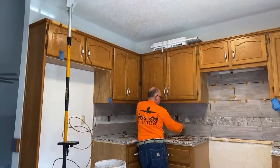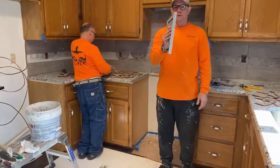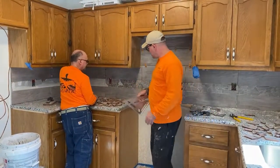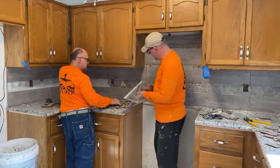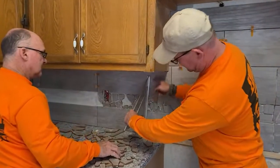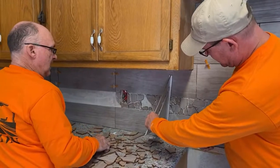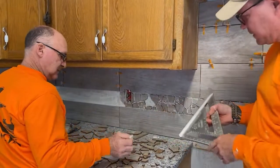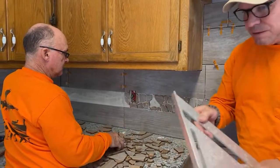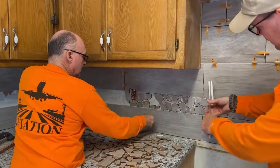He's using anything flat, like a straight edge, yes, flat surface, straight edge. You need a straight edge. So, as he's placing this tile in there, you need a straight edge to make sure the plane stays even with your other two pieces of tile. So he just pushes his mosaic in place there, squishes them in, and makes sure the plane is still level.